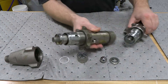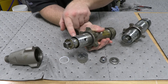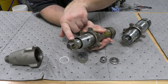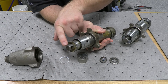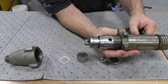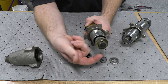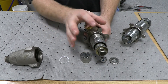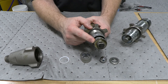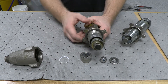Usually what you're going to see on a pump is that the actual inside of that wet cup has come apart. The spring clip that's in the top has got destroyed, and this piece has actually stuck itself to this. You can't see through that hole, so it's hard to get that pin out of there. We actually had to break part of that away to be able to push that pin out to separate this pump from the upper housing. This is typically what you're going to see, and you're going to have to find a way to get this off of the shaft without damaging the shaft.